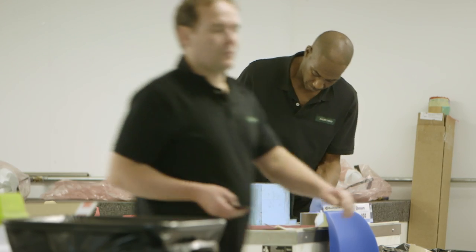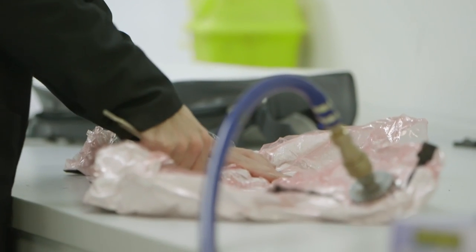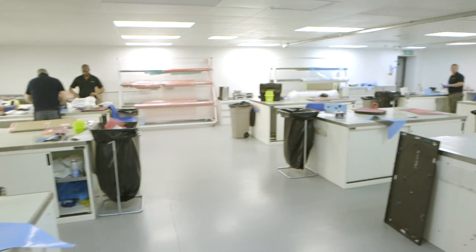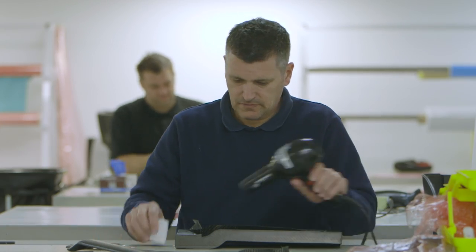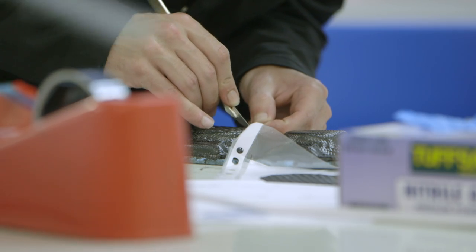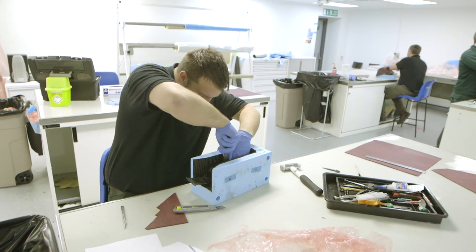Whilst the key to keeping the weight down is carbon fibre, from a manufacturing point of view that's no easy option and is the start of an immensely complicated and time-consuming process. The monocoque is almost entirely made out of carbon fibre, with some core components and inserts, but it's basically an entirely composite construction. It's laminated into a female mould in multiple pieces and then assembled through quite a few stages over several weeks. It's quite a big job for everybody involved in the whole company.